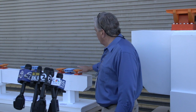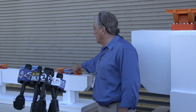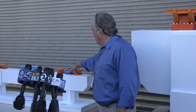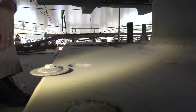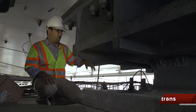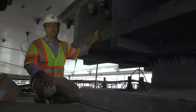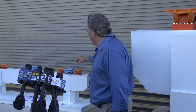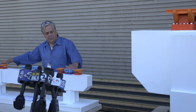There are four bearings and four shear keys. The bearings are the orange elements; the shear keys are the blue elements on top. The issue we've been dealing with primarily are the fractures of the bolts at two of the shear key locations at Pier E2. The bolts that are broken are at the base of the shear key, below the eastbound deck and also below the westbound deck — these are shear keys one and two.